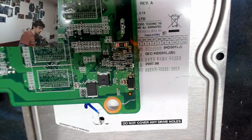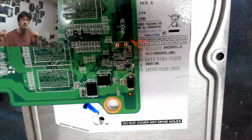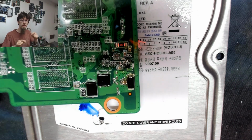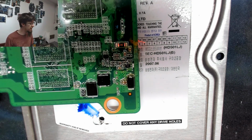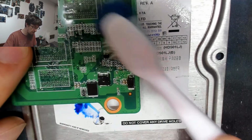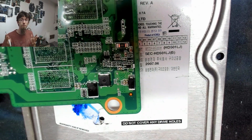Yeah, we're all good. That is all behaving as expected. And we've got a nice little reverse diode protection diode there again now. Right, so to summarize, for the folks who don't understand what just happened: on the input, where the DC jack connects to the motherboard, there is a diode, that's that guy, directly across the positive and negative terminals. A diode only allows voltage to pass in one direction, up to a point, with asterisks. So this diode is positioned against the flow of normal voltage.